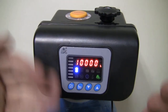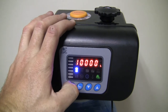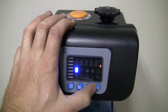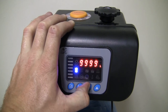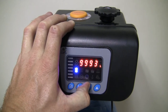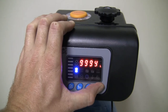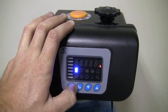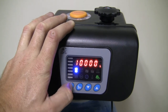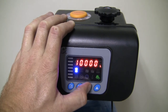It's a nice little feature because if you know that after a certain number of liters you need to do a regeneration, you can set it to that. All you need to do is click set and change it to whatever your literage requirements are — again, hold the button down to rush through numbers quickly. It's quite a nice feature of the F63-B3. I'm going to leave it at 10,000 liters for the sake of this video, but you can always change that.